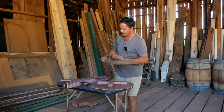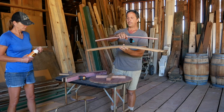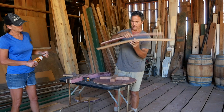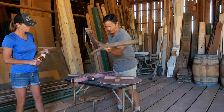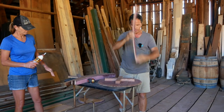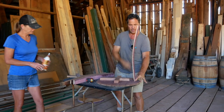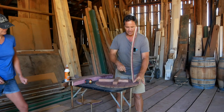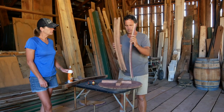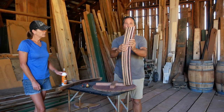Another important thing about the legs: here's a full stave and here's a leg. Don't cut one end off — cut the middle out, cutting both ends off. Also, this is not a 90-degree cut to the wood; it's cut so that the leg can lean back slightly. If it were standing on its own base, it needs full contact, so it's cut at that angle too. You can see on all of them — they're not cut square, they're cut to the angle of the base.